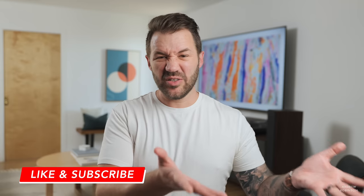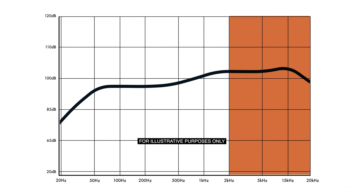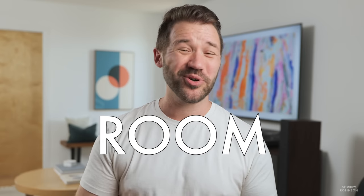Christy took the test and her high frequency hearing falls somewhere between 15 and 16 kilohertz, which is still pretty good, but helps explain why she and I don't always see eye to eye with respect to a loudspeaker being bright versus neutral. For example, I will often say this speaker sounds bright, whereas she will disagree saying it's just right. How is it possible for two people sitting in the same room at the same time listening to the same speaker to have two completely different reactions? Well, the simplest answer is often the right one — she simply cannot hear those high frequencies. All of those frequencies that inform us this is a bright speaker matter not to her, because a bright speaker has suddenly become more neutral for her.